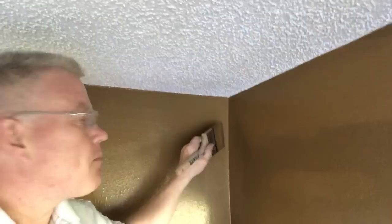Don't touch setting paint — it's going to alter the appearance and put a texture on it. Think about touching drying gum on the ground: you step in it and pull off and it looks like taffy. Same idea with paint. You can touch it while it's wet, but after you've left it alone for about a minute, go in one direction only and join the wet with the drying by lifting up where you feel the resistance — that's where the paint is setting up. Lift the brush going toward the drying edge — that's how you unify your paint.